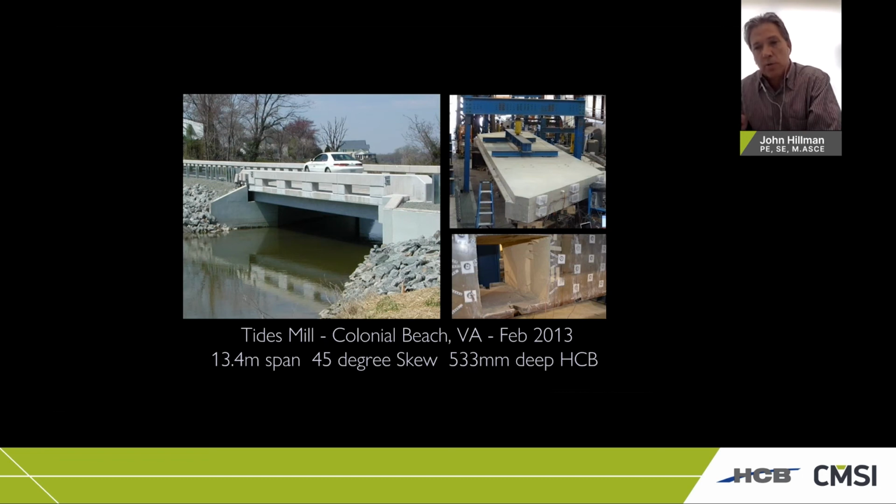And part of that's just because we're using 1860 MPa strand. I mean, if we used a lower grade strand, instead of 1860, used like 1000 MPa, we'd get much closer to a balanced design between strength and deflections. The other thing I want to point out is that the steel, and we've done studies on this too, the steel is still fully encapsulated in the polyester resin, and it's on the top side of the FRP laminate. So the likelihood that you're actually going to get significant damage to the laminate, and then also get to the strand, and then also get the corrosion to the strand through the galvanized coating, is actually a lot smaller than you've got for a pre-stressed concrete beam.